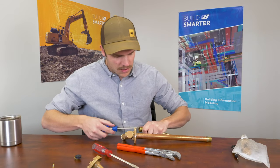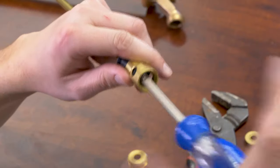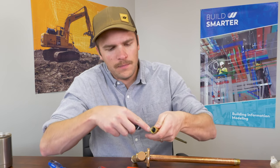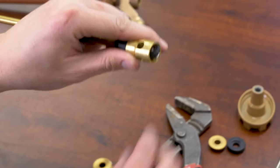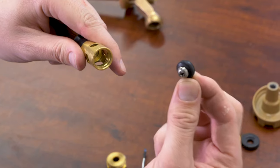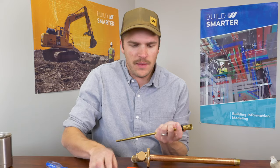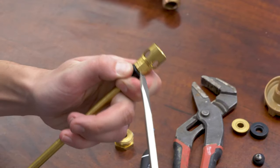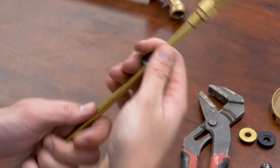Make sure you get the right size screwdriver so you don't strip the screw, because these can strip and then you're going to have to replace the whole thing. Remove the retainer screw, then remove the valve seat rubber — kind of pop it out with a little screwdriver. Then remove the check valve rubber. This one can be pretty tough, so pop it from there, pull down to expose the gap, and work it out like that. That one will fight you — keep with it.